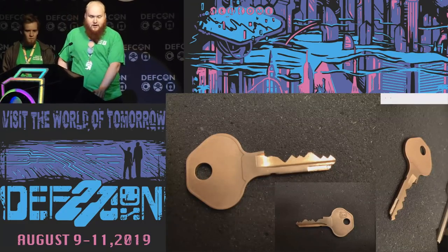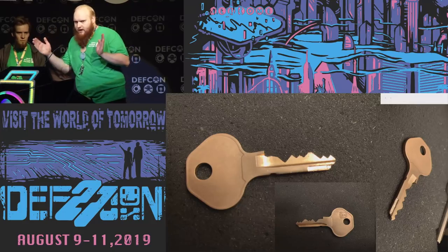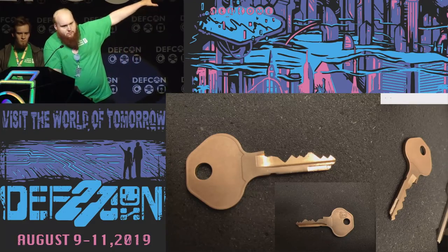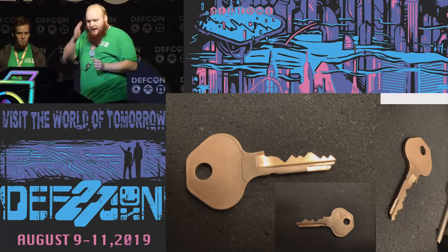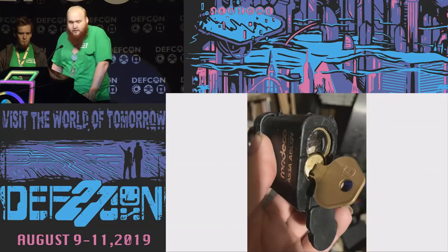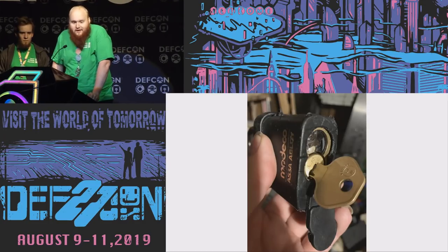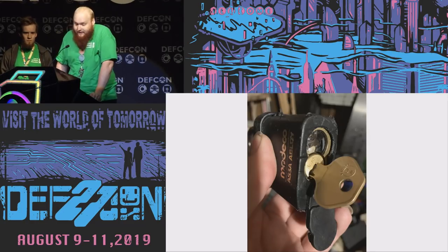So we took a Master Lock blank. We used an M19, which is a little bit longer than an M1, because a Medeco is a long lock. And we filed away to allow it to operate with the M3 slider. And we added the Medeco cuts to it. And we created a functioning Medeco M3 key on a master unrestricted 19-cent M19 blank.